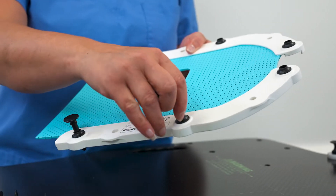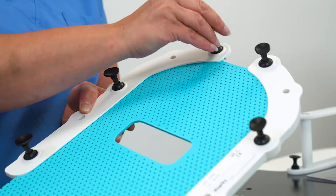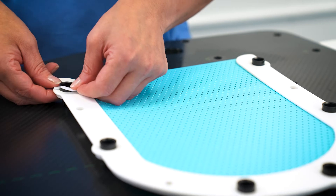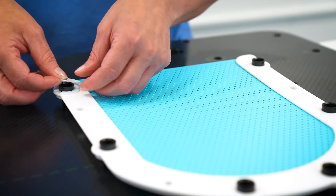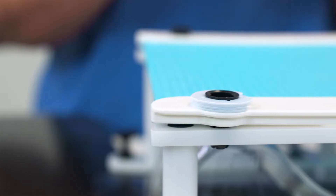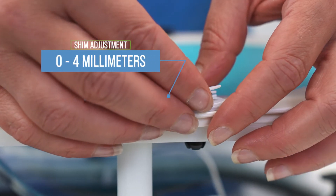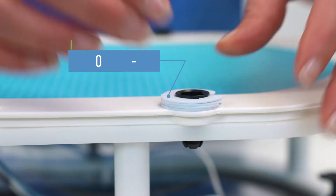To begin, insert the pins into the top mask. Take the bottom mask and place the shims at each pin location. We recommend starting with two shims so that you can shim up to four millimeters or down to zero, creating a zero to four millimeter range of adjustment at each pin location in one millimeter increments.